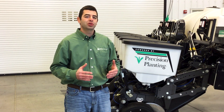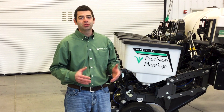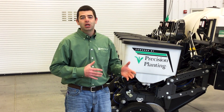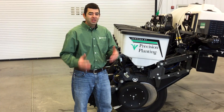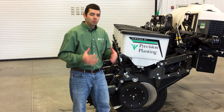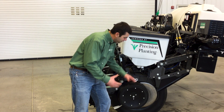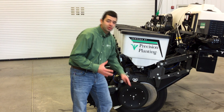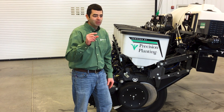It's one of those building blocks to making sure that we get our crop, whether it be corn or soybeans, off to an ideal start. We're going to share a little bit about the information we know about it, and then also what we've learned through our studies in 2019. To me, downforce is a math equation. What we're trying to do as planter operators is maintain a constant, desired amount of force or weight on these gauge wheels so that we maintain ground contact and are able to achieve that desired planting depth.